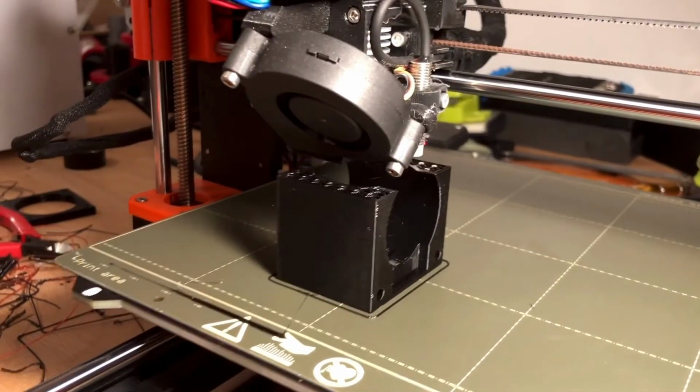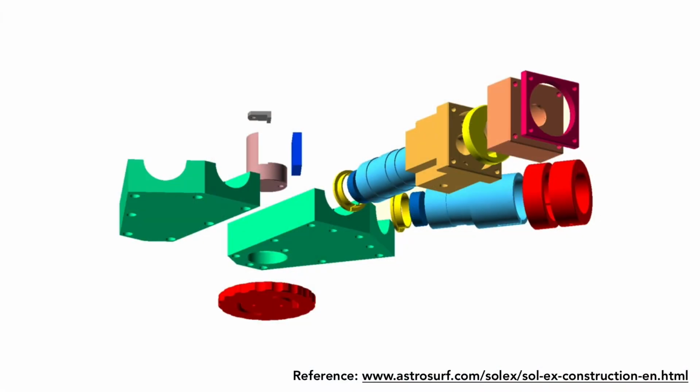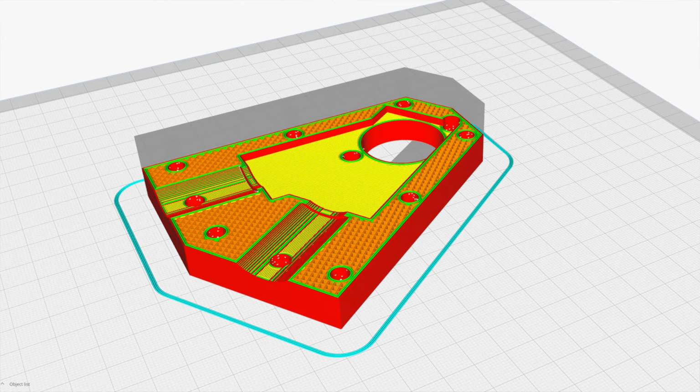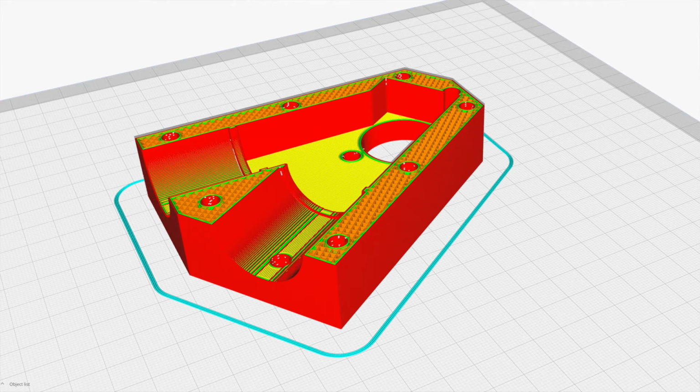All the mechanical components of the spectrograph, with the exception of the two helical focusers and some standard M42 or M48 adapters, are 3D printed using PETG. It is strongly recommended to avoid PLA because experiments have shown that PLA is transparent to infrared radiation, while PETG is not. There are about 25 parts to print. Most of them are relatively straightforward and should not cause any problem. Overall, this is not a hugely difficult project to print.